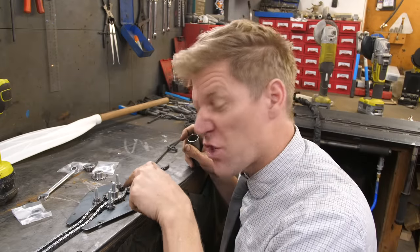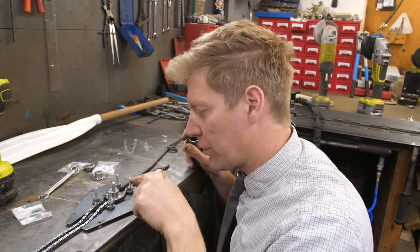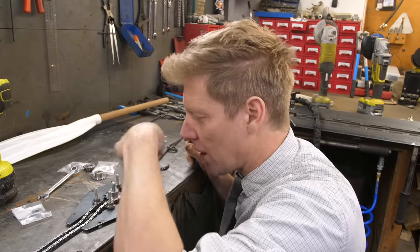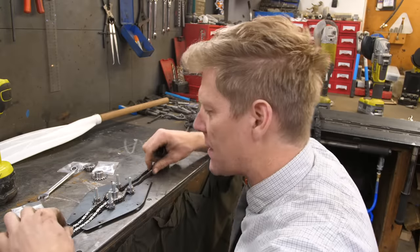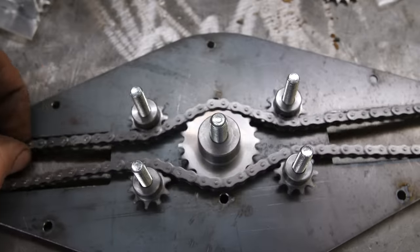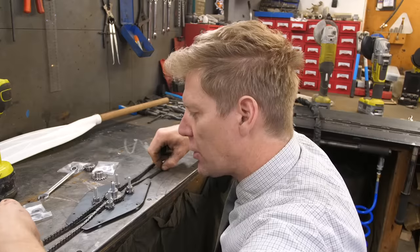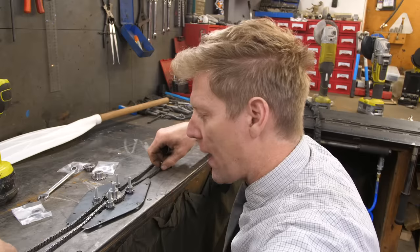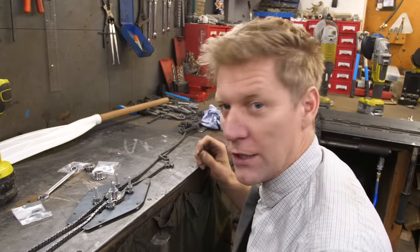That's the centre bit. This middle cog, which is just over a bolt at the moment, will be on a shaft attached to whatever power source we choose. The chain goes up and over it, back and forth - if the chain's nice and tight, it should go across the top and pull back underneath in equal amount, therefore spinning the propellers at each end.